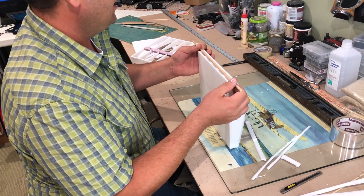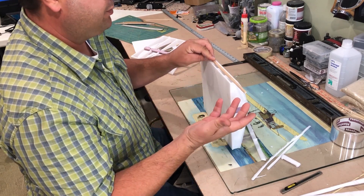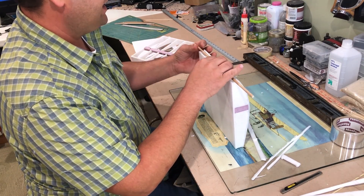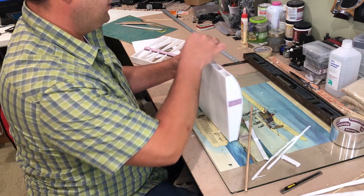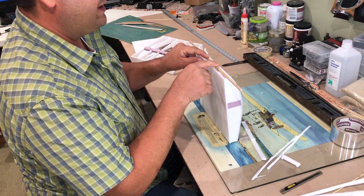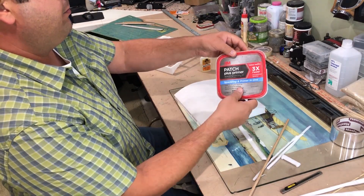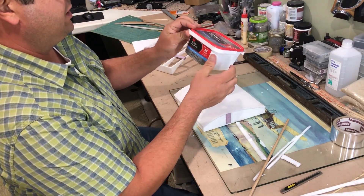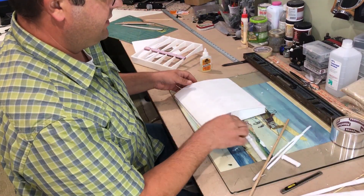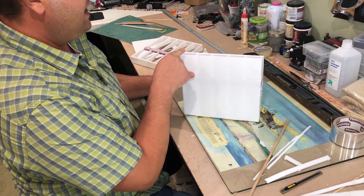What you can do is use a piece of wood to make a leading edge. This is a little bit too small, but the point is that I could get a piece of wooden dowel from Home Depot or Lowe's - I think this is quarter inch dowel, so maybe half inch dowel. And I take a little piece of that, wrap some sandpaper around it, sand in a groove in the front, and then just glue that dowel directly - and that becomes your leading edge. And then you can use spackle. I prefer the 3M Patch Plus Primer - this stuff is awesome. Get it at Walmart, it's cheap, it doesn't shrink, and it sands really easy. Hardens up really easy with water-based polyurethane, and you can use that to blend in the transition between the dowel and your foam.